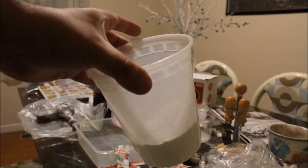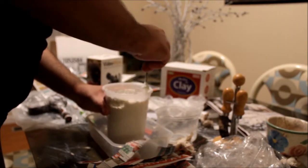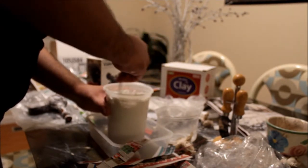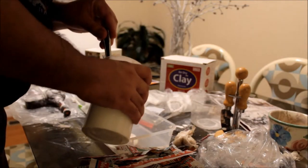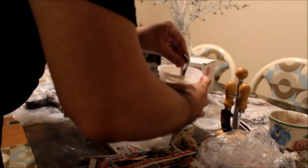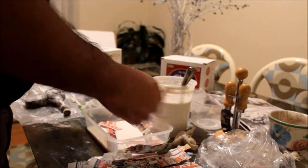Take the plaster and measure it out following the instructions on the packaging. Add water or plaster as necessary until the consistency is sort of halfway between mashed potatoes and clam chowder — maybe a thick pancake batter. It should be thick enough to retain shape, but not so thick that it doesn't spread when you pour it. As the plaster reacts with the water, it should dissipate heat.